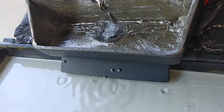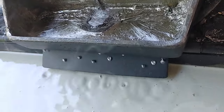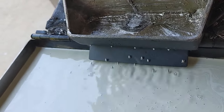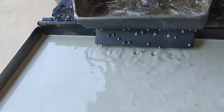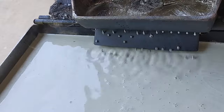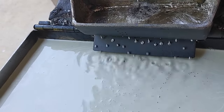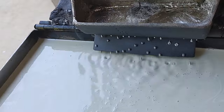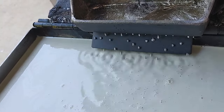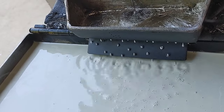There's one thing you can be assured of — that lead is not overheating. If you occasionally have a dripper or two stop, that's a good thing. You know you're not overheating your lead, because that is an absolute bad thing. Getting your lead too hot gets more dangerous; your coolant has to be mixed heavier with more oil to prevent the shot from exploding.